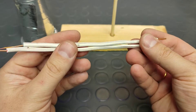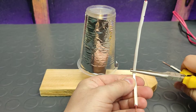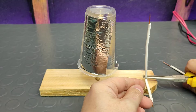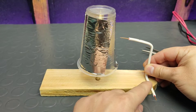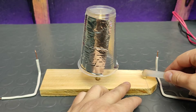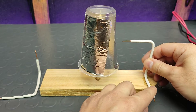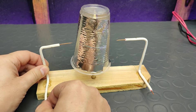Then I will use two pieces of copper wire with sharpened ends. They have to be shaped so I can glue them down firmly. I will place those two wires on both sides of the cup, standing close to the plastic cup but not too close, because it could cause arcing and potentially deteriorate the cup and burn the high voltage generator. It is very important to make them sharp on the ends, because this will help the high voltage to travel through the motor and make it spin.